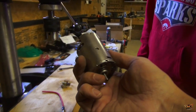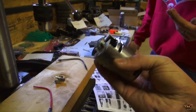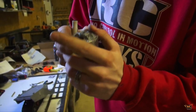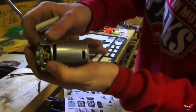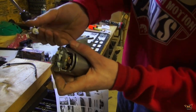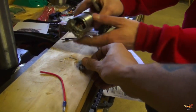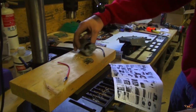Rebuildable motors - these are the 820s. Here's where the brushes pull out. David showed me this awesome little trick. I don't think a lot of people have seen these from Kershaw - these are out of an 18-volt DeWalt XRP drill, the biggest baddest drill motor you can get that will fit, and we've got two of them. There's no real way to get in and solder to the tab - you can solder up here but it's very hard. So these are removable - you just take a small flat screwdriver, stick it in there, pop it out, slide it out, and then you have full access to do a beautiful solder joint. You can rebuild, put the brushes back in no problem, and you can clean the commutator. Now I better get to soldering.